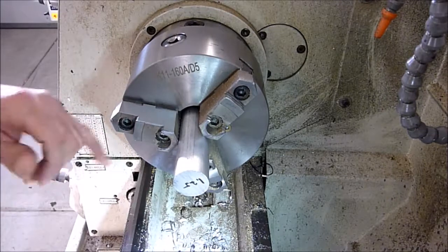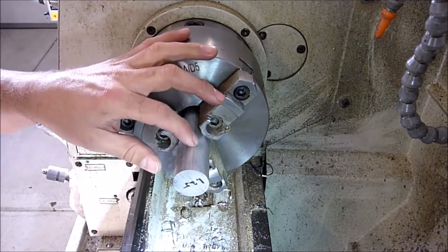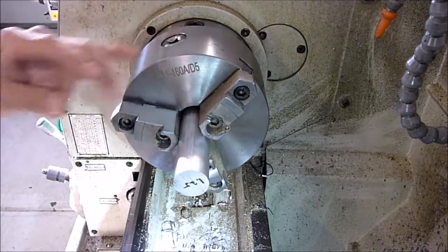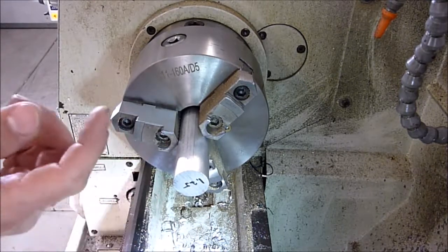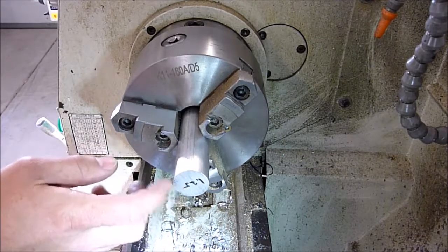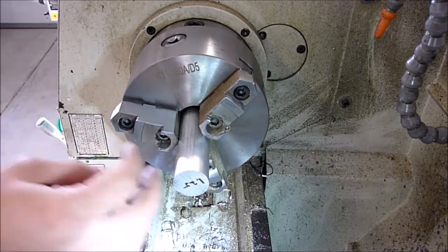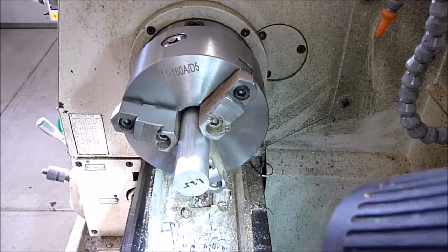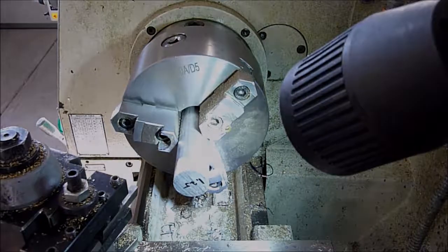And then we'll probably drill and tap this and make a little brass locking mechanism so that you could actually lock that as well if you didn't want that to spin. So we'll go ahead and get this face drilled, bored out, and then we're also going to thread it so that we can put a cap on it, and we'll cut a hole in the cap so it looks nice with just the shaft sticking out of there. So it should be pretty nice. Got some ZZ Top on, and let's go ahead and machine this down.